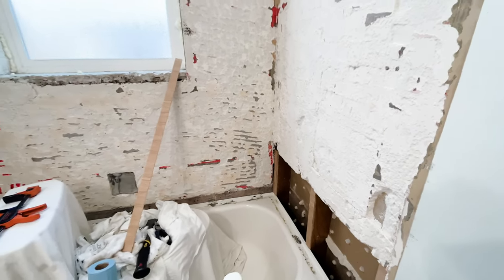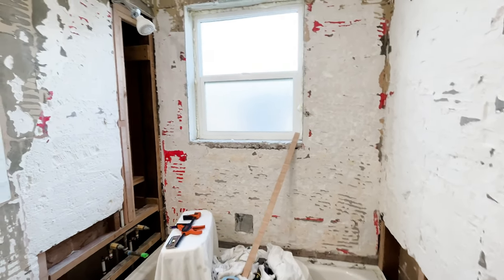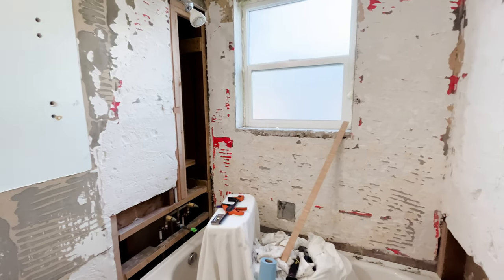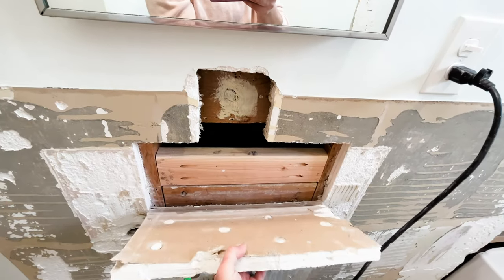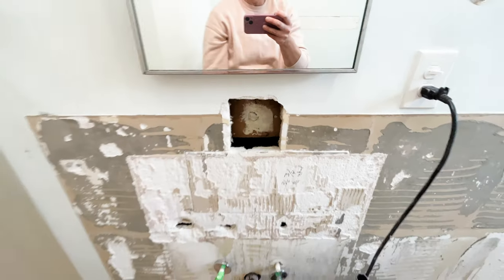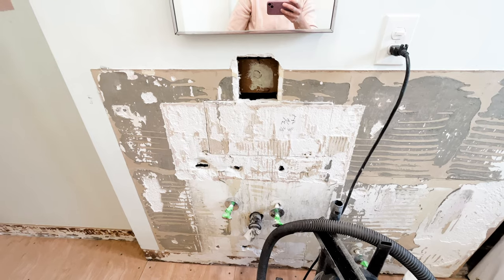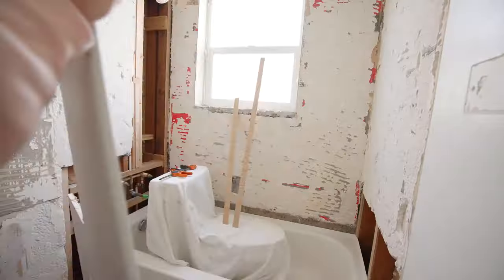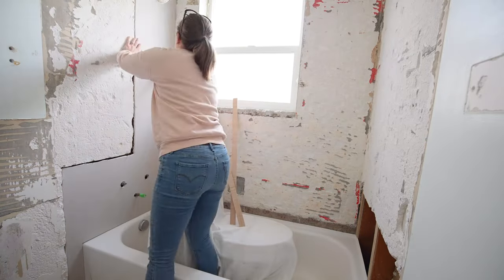After that, I'm going to plaster over these walls. For the sink, I did add the brace and cut this out so I can reuse it, so now I'll just screw that back on and start plastering all those wonderful holes. We put new drywall in and shimmed it out to give us the most even walls possible.